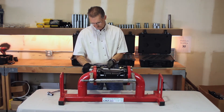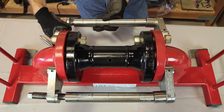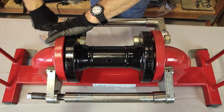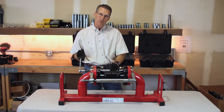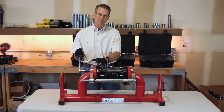So the plates are going to slide in. You'll hold them in place until you get it snugged down. When you start jacking on the jack bolt, the plates are going to cantilever back and they're going to bind the bolt hole pins inside the bolt holes.